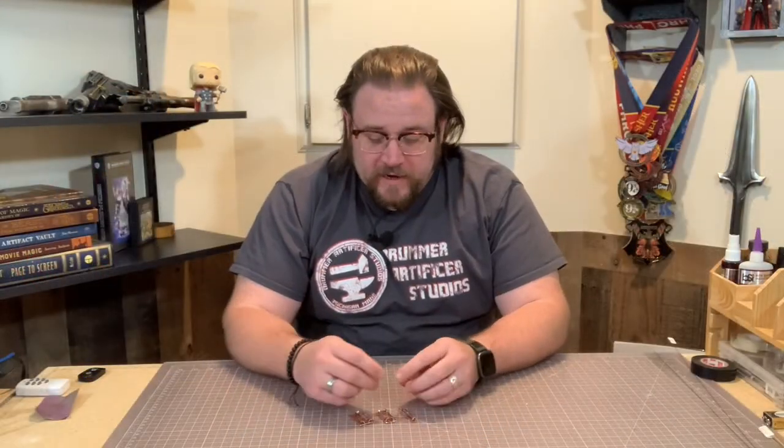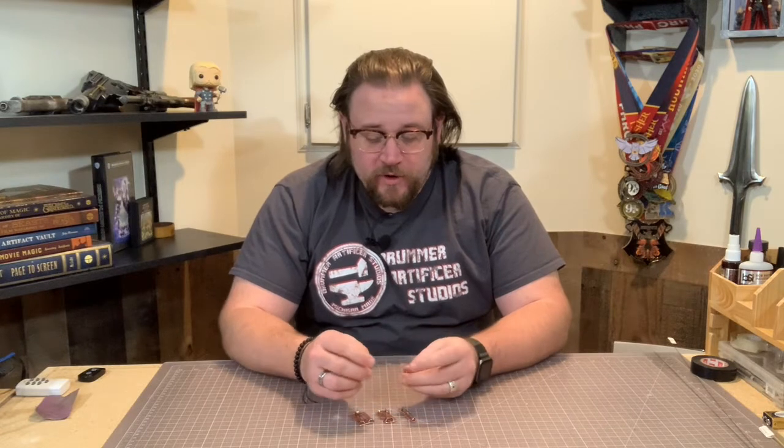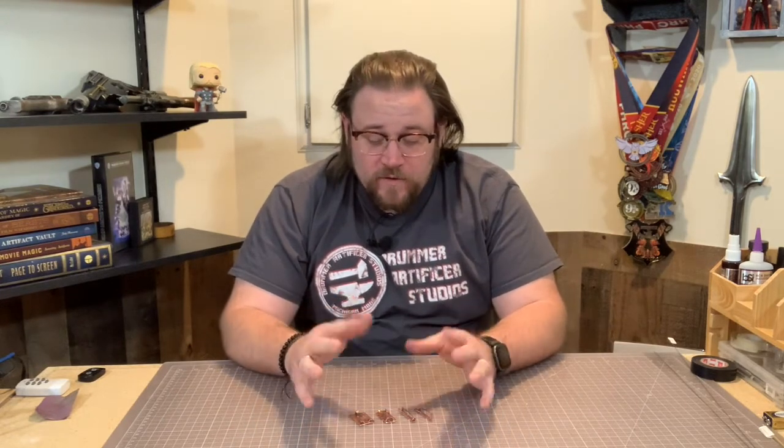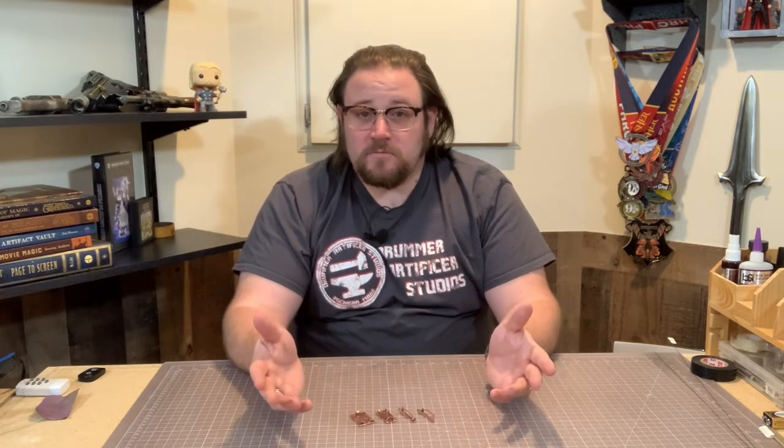So there you have it. We used some 18 gauge copper and a few inches of music wire — high tension steel wire — to create four distinct but similar pin backings for you to attach onto something you might be making. Hopefully you were able to follow along. Remember that these designs are not all you're limited to — you can adapt and modify them to fit whatever you're looking at doing, and you can even have it designed so that these pieces are cut out and protruding from the back of your piece without the need of attaching these parts to anything. Play with it, figure out how it works for whatever you are doing. If you have any suggestions for other videos you'd like to see, feel free to leave a comment. Thanks for watching — this has been Alex with Drummer Artificer Studios. See you next time.